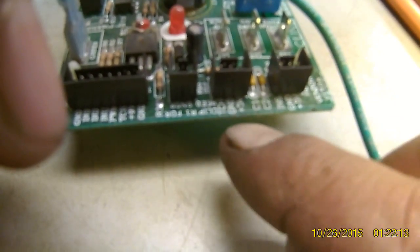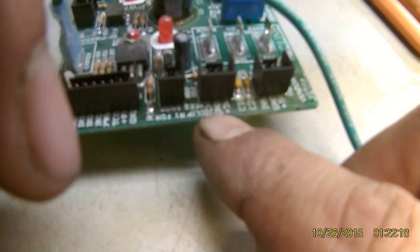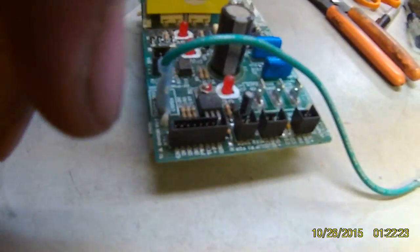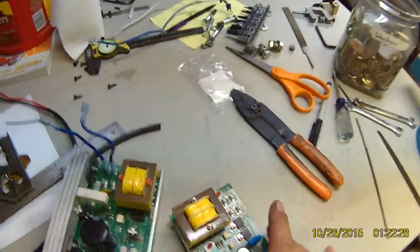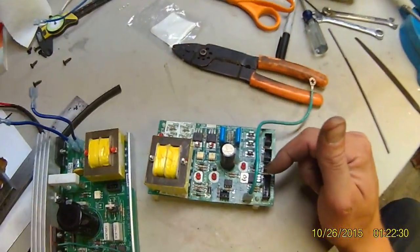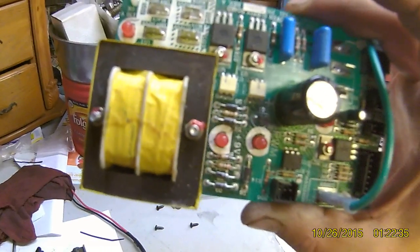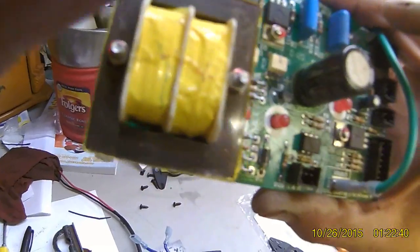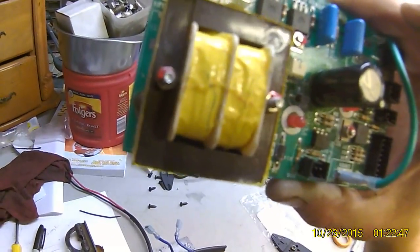It's probably this one. This is TCH ground, five volt — so that's probably a tachometer. Then you have a bunch of other stuff over here. If you do get one of the older models where it has the dual boards, I personally wouldn't throw this board out because you can use it as a controller. It has both a five volt and a nine volt, and it's got enough amps to move the incline motor.